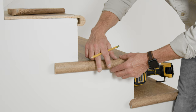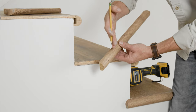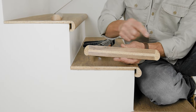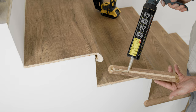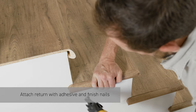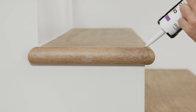If one or both sides of the stairs are exposed, you'll also need to apply return trim for a proper finish. The return is pre-mitered on one end, but if the walls are not square, you'll need to cut the proper angle. Once properly fitted, attach the return with a small amount of construction adhesive and three finish nails. Use matching putty to hide any nail holes.